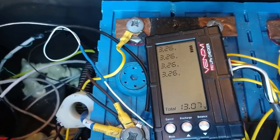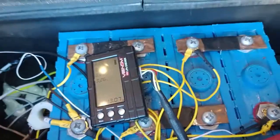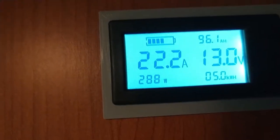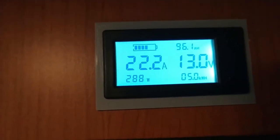It's been an hour and you can see our BMS is doing a great job. We've pulled a number of amp hours that that questionable cell can handle, so it's in its happy space. I've got TVs on and the fridge on, and we're pulling 22.2 amps. We're down to 96.1 amp hours left, so we'll come back in an hour and see what's going on.